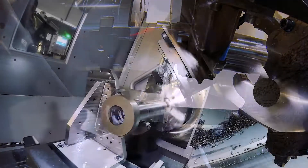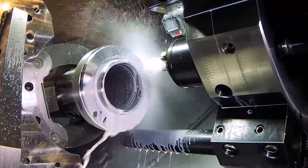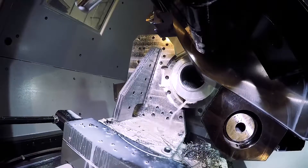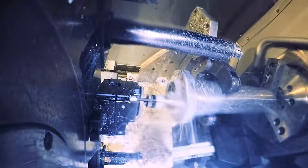Now we turn the OD and front face of the shaft. Next we drill 12 holes equally spaced around the spindle front face — these are the holes where the customer's chuck or adapter plate will get bolted to the spindle. And lastly, we finish up by tapping those same 12 holes we drilled earlier.